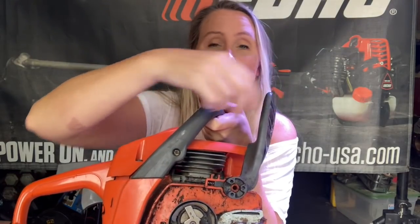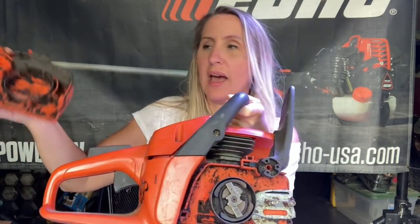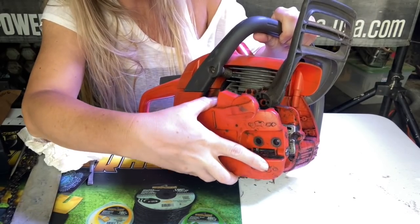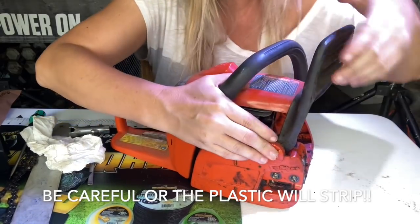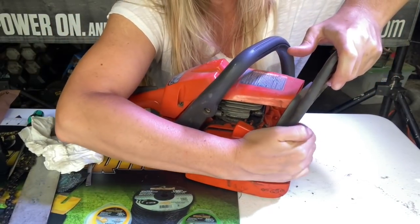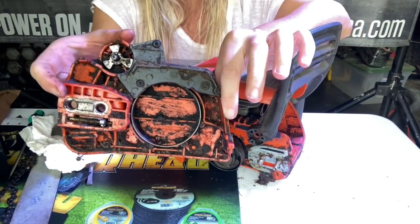Now, a lot of times when this happens, you have no tools on you to fix it. There is one way you can try to do it and it will work if you hit it just right. The plastic inside of your handle — your chain brake handle — has these little star notches. The clutch cover has a metal piece that is part of your chain brake and it fits inside of that plastic part. You're going to put the side cover back on the chainsaw and line up that gear to go into the plastic part, go forward a little bit, feel it slide up in there, then push really hard. Grab around the front and pull back. Hear that pop? We just disengaged the chain brake.